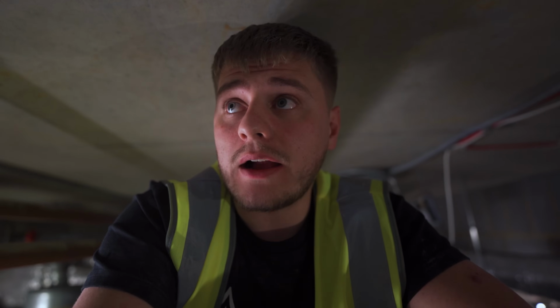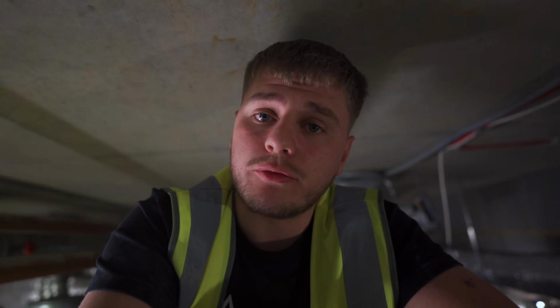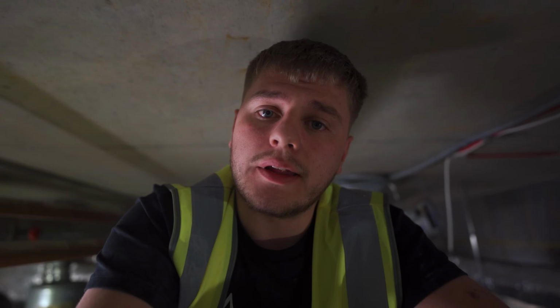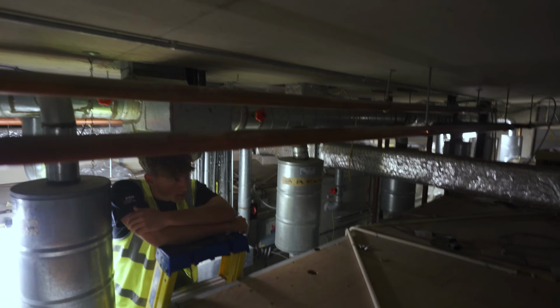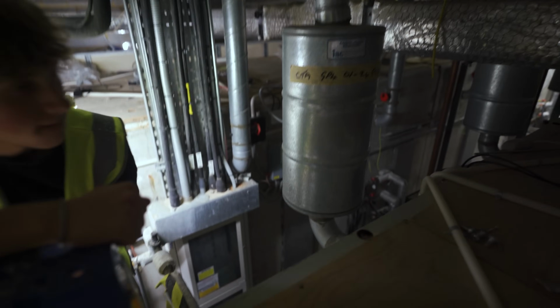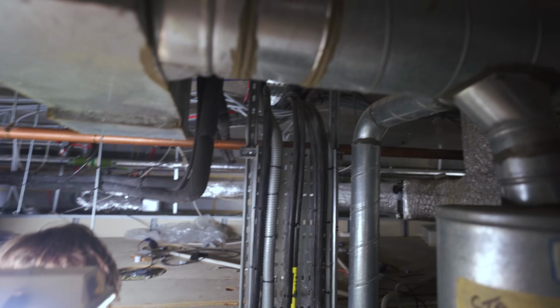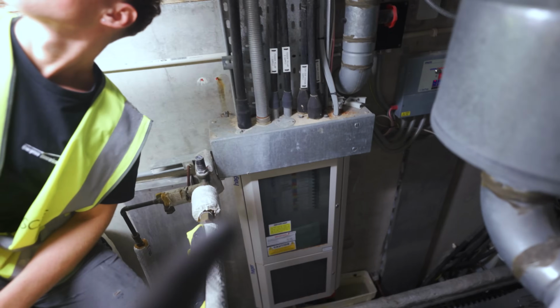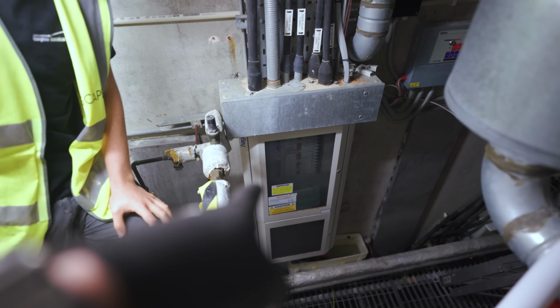Well, I'm now in the ground floor service corridor, which is exactly the same as the second floor, and I'm just going to show you the route through there and the board that we're going to hopefully get this submain fed from. So that's the same riser that we're going to be travelling down. We're hopefully going to come out onto this slab, past the wetness, and then over here, next to my glamorous assistant, is a Hager three-phase board. So we'll hopefully get onto this tray or something, and there's one spare way. So we're going to have a 40 amp single-phase supply fed from this board here.